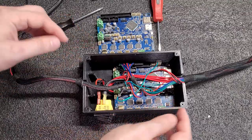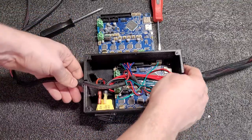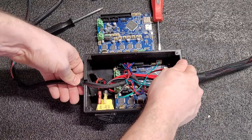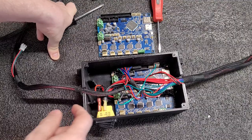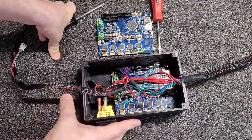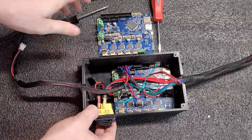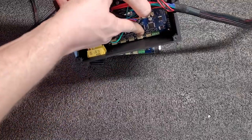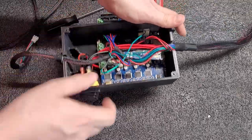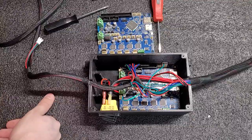As I said, these two wires here are going to be epoxied in place and you're not going to be able to move them. So we're going to perform that board swap doing this operation. This is one of our Pro boards, which is also the same as our Super and XL. The Micro has slightly different connections — the Micro will have connections on this side of the board. But the connectors just need to go back into the same plugs they come out from.